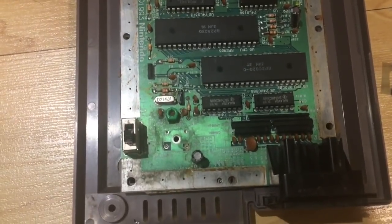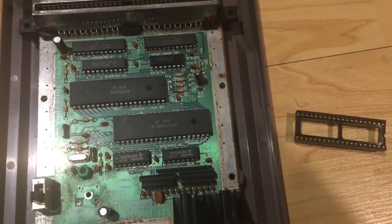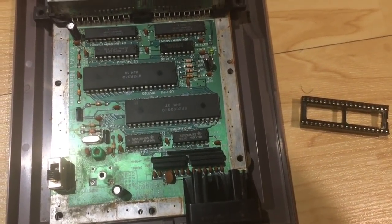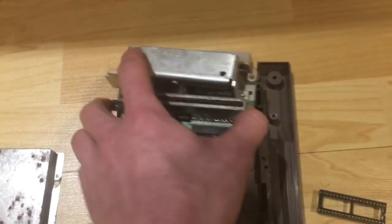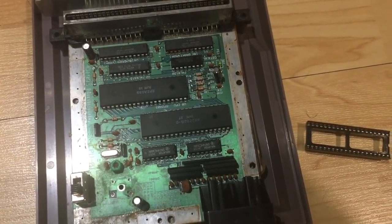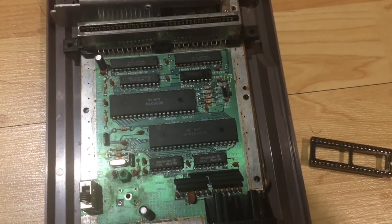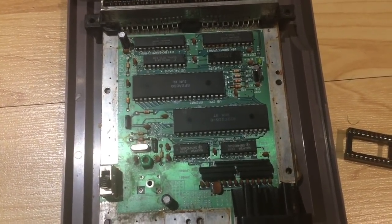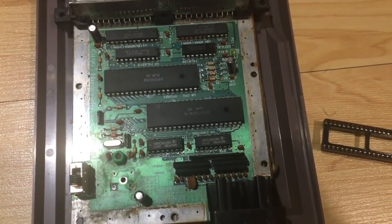The oscillating crystal works — we were getting a clock signal even before I replaced it, and it still does the same thing after. Stay tuned for the next video. I'm waiting for a better desoldering iron that I've ordered, as a good desoldering iron will make removal of these multi-pin chips much easier than using solder wick. Hopefully part three will be the conclusion where I get this system up and running properly. Thanks for watching — subscribe to the channel, leave a comment below, and if you have experience with top loader NES repairs or insight on the troubleshooting I've done, I'd love to hear from you.